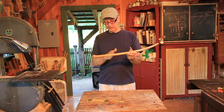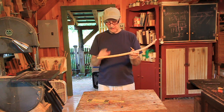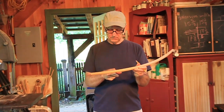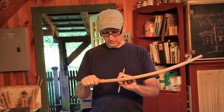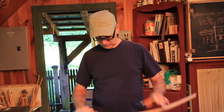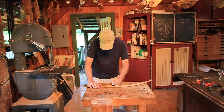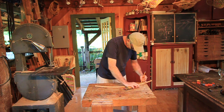But I can't start shaping my tenon, so I've got to shape a 3/8 tenon here. I can't start shaping that tenon with the draw knife right where the post is. You know, that ain't going to work. So the crest rail gets tapered slightly right through here, so I can back up a bit and give me some room to work. Now if I do it at a known point, so let's just say 2 inches, that probably works.